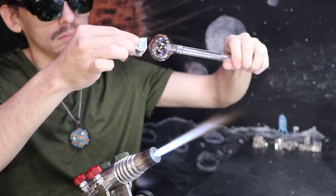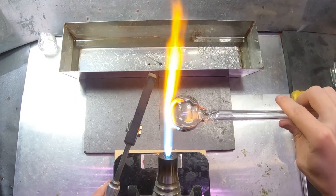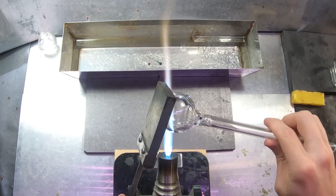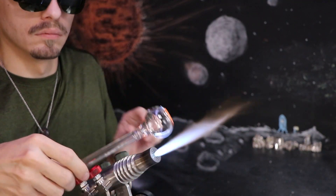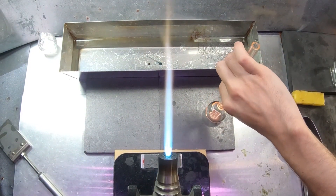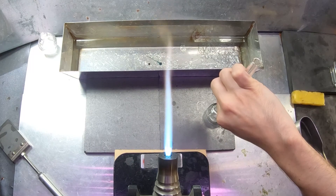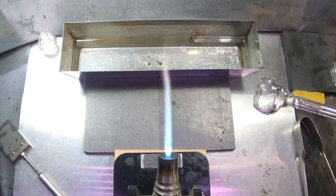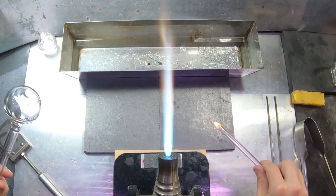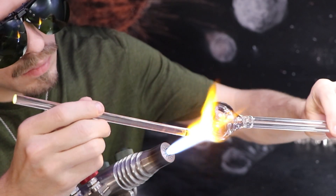Comparing the sizes now, my container might be a little bit too small. For the examples I've seen, they'll normally melt two to five pounds down in a large saucepan, then allow it to cool to start to solidify and set up. The crystals should begin to form along the inside of the pan and grow inward towards the center. But being a large mass, it'll still have enough heat in the center to remain liquid — that's when you break the top open and pour the remaining liquid bismuth out. What you should be left with is a pan covered in bismuth crystals. You don't want the pan to completely cool, or else you can't pour the center out.